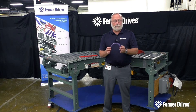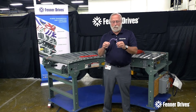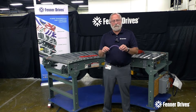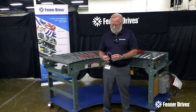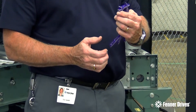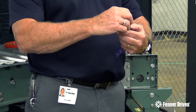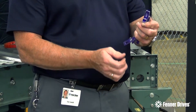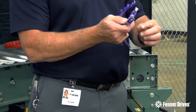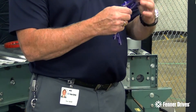Taking this belt apart is very simple. The tabs run to the inside — they would be riding on your snub rollers, pushed up against the conveyor roller. If I turn this belt inside out and put a tight bend in it anywhere, I twist that tab on top of the bend, and you can see that link pops right over. Now I just twist the belt. Very easy to make the belt to length, very easy to assemble it on the conveyor.